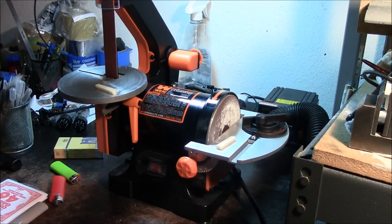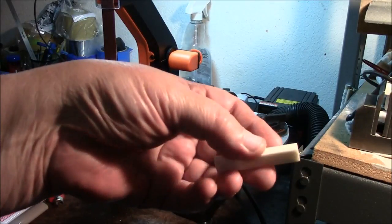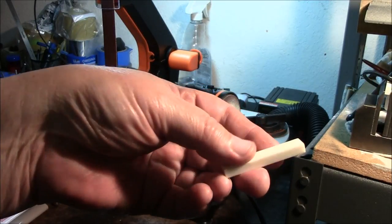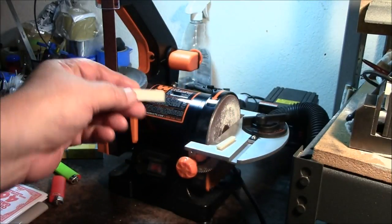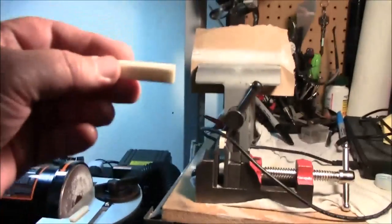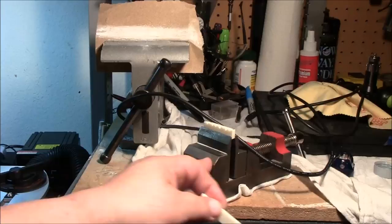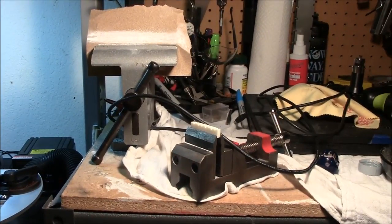But there's just so much bone to be removed, okay? So I'll saw away some of this on this raw stock I've got here. On this one right here, I'll mark it, cut it with my bone saw, and then put it to my sander to get a rough shape, then take it to my sandpaper and do the finish up, then put it in my nut vise, which you see had one in there right now that was being worked out for a special, weird application. And then we're going to groove it.